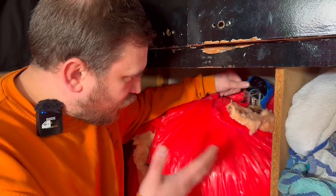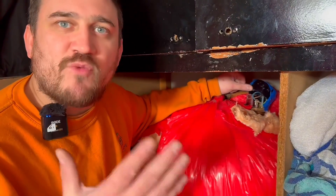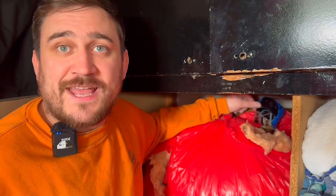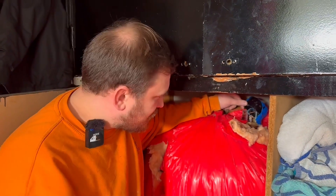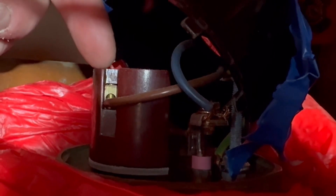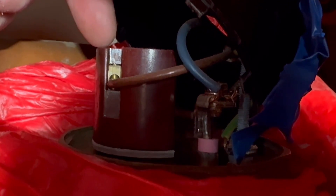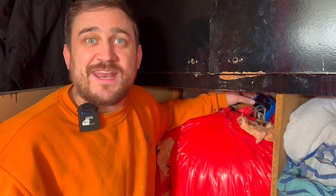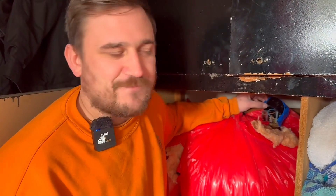What we're looking at is: can we physically and immediately touch something that is going to cause an electric shock or electrocution? The answer is going to be very tough to call, because the way the terminals are designed, they're greater than IP2X — so we can't physically touch any live part with a finger. Really interested to see what people say in terms of C1, C2, C3, or maybe an FI — find out who broke it.